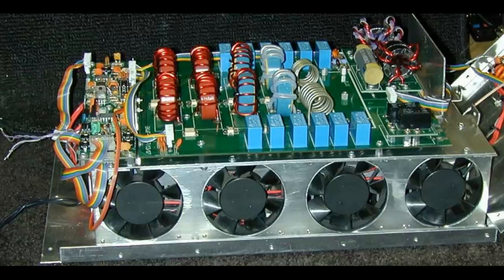All of the ALS series of amplifiers have plenty of fan speed. The fan could even be slowed down by changing some resistors on the circuit board, which also change the slope of the fan from room temperature up through thermal limits. All of these resistors are programmable — by selecting different sizes you can control the slope of the fan with temperature and also the minimum fan speed at room temperature.